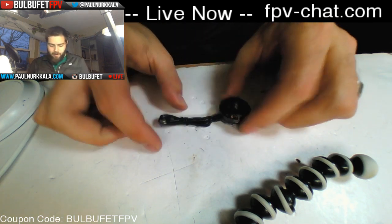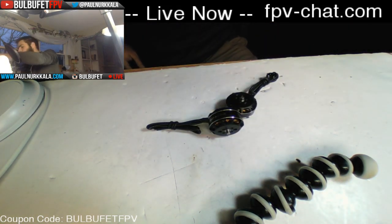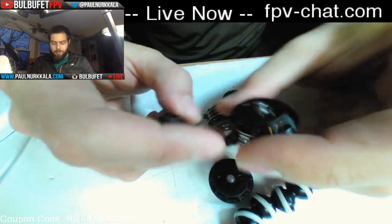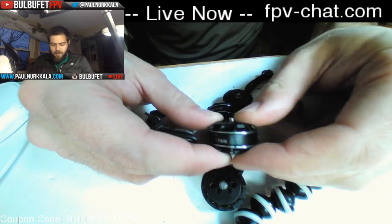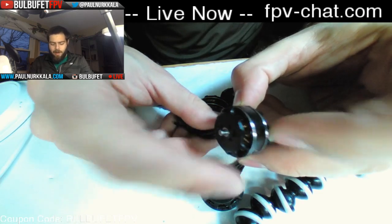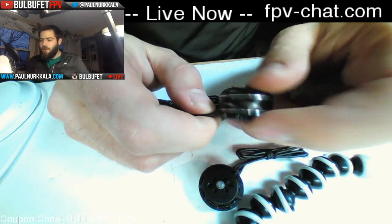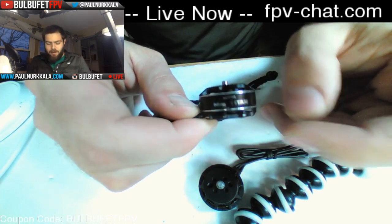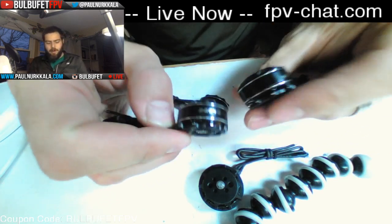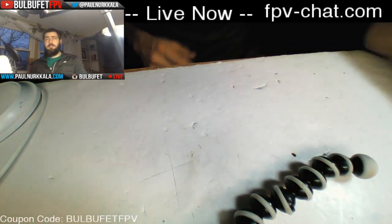So that's fine. We have four of the MultirotorMania 2204 by 2300 kV Airbots or Mini Titans. They are very, very powerful. These are actually the first 2204 motors that I bought, and they flew great. I was only on 3-cell at that point, so I don't know how they are on 4-cell, but I have to imagine that they're going to be pretty impressive. I think they do about 1,000 grams per corner on 4-cell with a 5x4x3 prop.